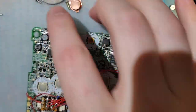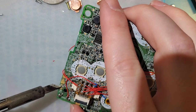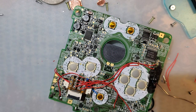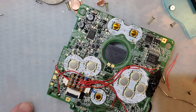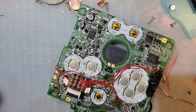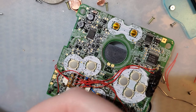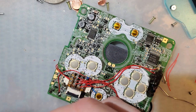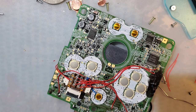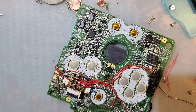Easiest way to desolder these is quite destructive, but just get your iron on both sides, do one of those, and those are sensitive to heat. I probably had that stuck to the iron way too long, but if I need to reuse it, it's there. It might still work. The replacement is just an 0603 LED. I have blue, green, and red. Blue obviously works just fine, but I'm not feeling that. I just did blue, and it's going in a blue shell, so...